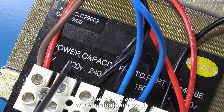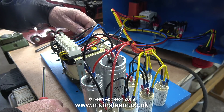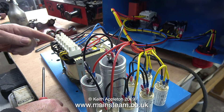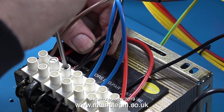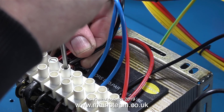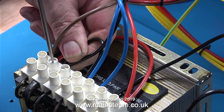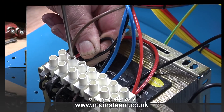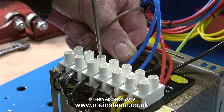I noticed that the transformer has a 220 volt winding, and although this video is called taking a look inside the Transwave unit I couldn't resist switching the wires over. I thought well, if the voltage is low to start with it shouldn't make a difference. So I transferred the two black cables from the 240 volt winding to the 220 volt winding. I stood clear and switched on the unit again and when I turned the lathe on it was exactly the same as before I changed the winding over — so much for that idea. I put the two black wires back where they were, unplugging the unit from the mains first.